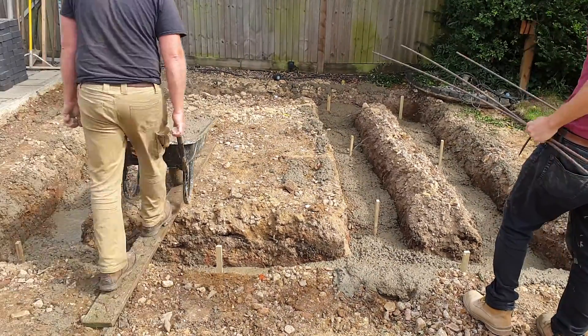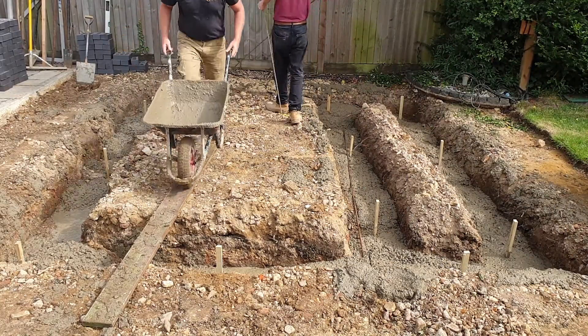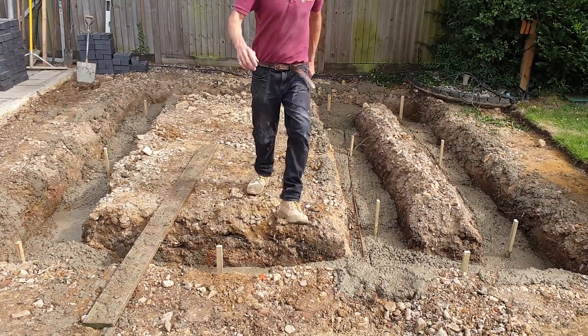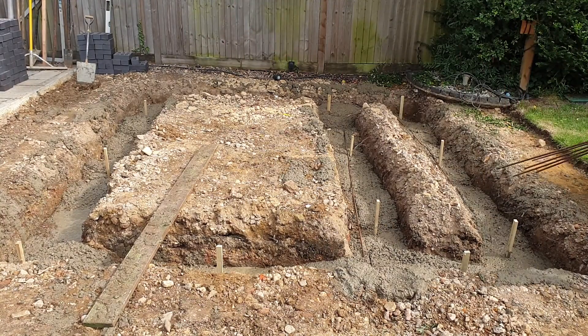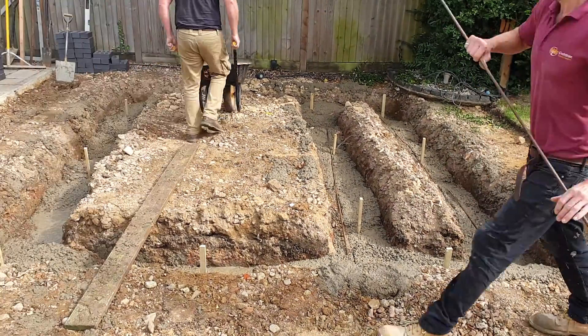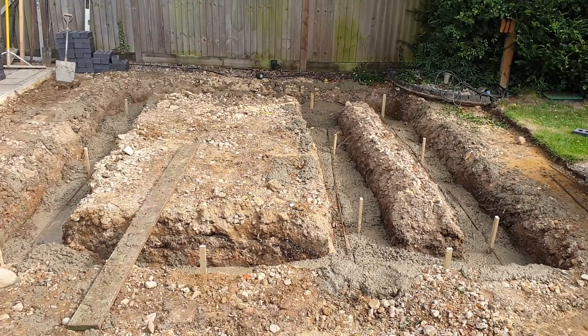On this project we're installing two rows of rebar centrally after the first and second layers of concrete. All steels are kept 100 millimetres from the edges of the footing to prevent moisture eroding them. If you're installing rebar or mesh prior to pouring, don't attach them to the battens.